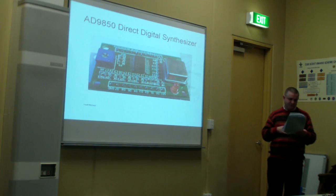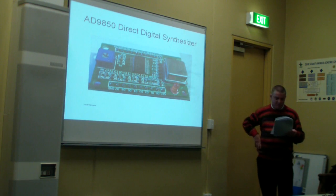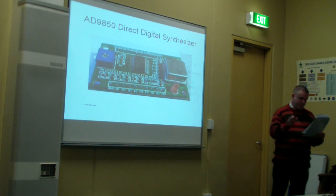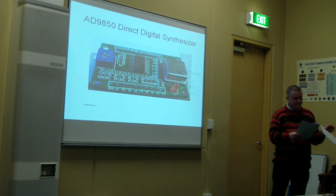So my transmitter version 1, my initial idea was to have the DDS, that's this board, transmit my call sign and my latitude and longitude via radio teletype at 50 baud. I figured that even though the power output would be low, the use of high HF frequencies, and a narrowed down mode would mean the signal could be received a long way away.